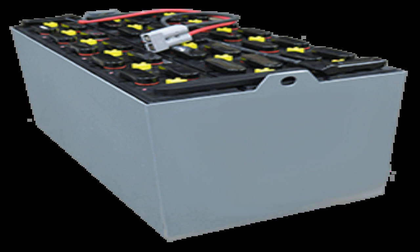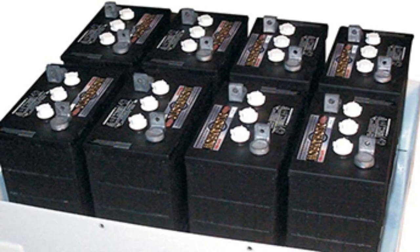Conclusion. Different homes will have different power requirements and will need battery banks sized accordingly. If you build a battery bank using any of the three batteries mentioned above, you should be able to create a battery bank that is just right for your needs. There are some exciting new developments in the battery world, like the lithium-ion Tesla Powerwall, which should be entering the market over the next couple of years. But at this time, our three favorite batteries for residential off-grid alternative energy systems are golf cart batteries, L-16 batteries, and industrial batteries.